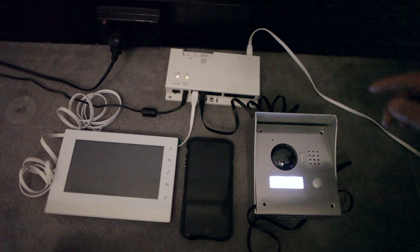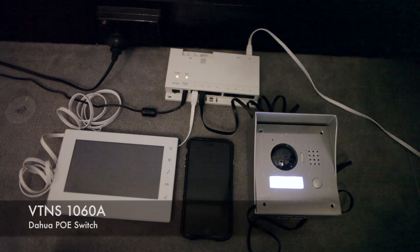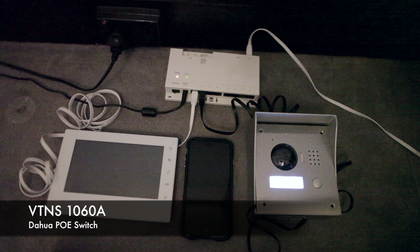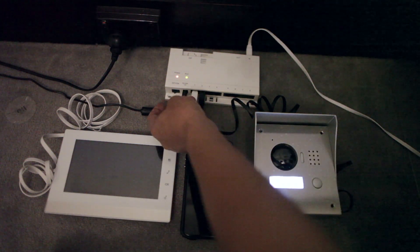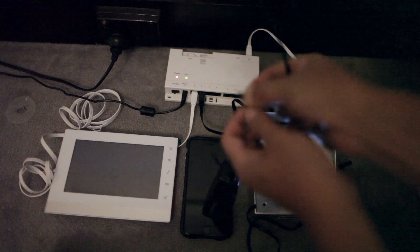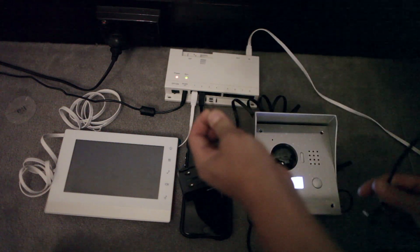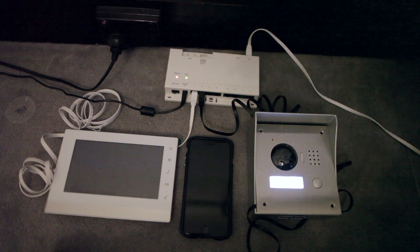What we've got here is a PoE switch from Dahua, the VTNS1068. I've managed to find a power pack from an old LaCie hard disk that seems to work, because the one that actually gets shipped in the box — they don't tell you this — it's not connected. So they expect you to do a bit of soldering yourself. I don't have a soldering iron, so I managed to find a cable that fits.